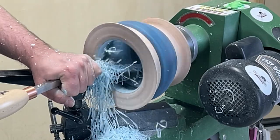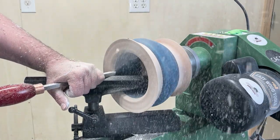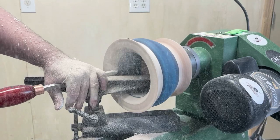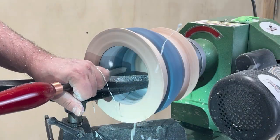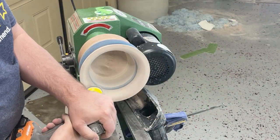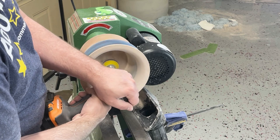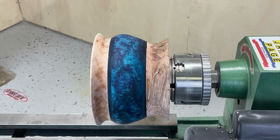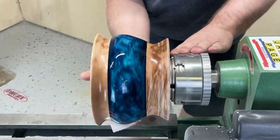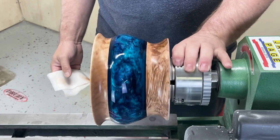Right now it's time to hollow out this bowl. My main objective is to not wreck this bowl — we went through all the trouble, it's been on the live show, I stabilized the wood, we cast it together, and this guy's expecting it. So I don't want to make a funnel or go through the side. I'm going to make a nice transition from the bottom to the side and from the top to the side. I'm going to sand starting at 120, then 240, 320, and ending at 400 grit, then go to Yorkshire Grit. And here's my favorite part — denatured alcohol after the sanding — and there are those swirls! I'm so happy I kept turning a little bit further to get those swirls out.